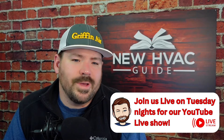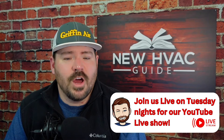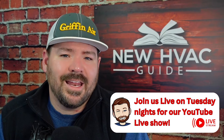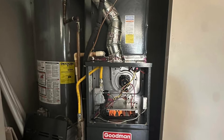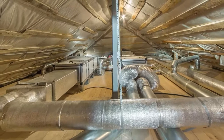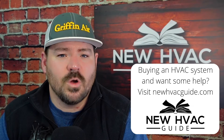I would encourage you, even if you already know who you're going to hire — if you have a heating and air company that you really like and they've always treated you well and you're not going to get multiple quotes — I would recommend getting at least a couple of inspections of that ductwork. In my experience there are times when heating and air guys will be those box changers; they'll swap that equipment and they're not taking the time to inspect that ductwork, make sure it's sized correctly, check static pressures, and make sure that everything is in top shape for efficiency.